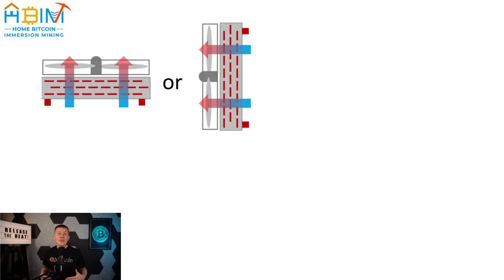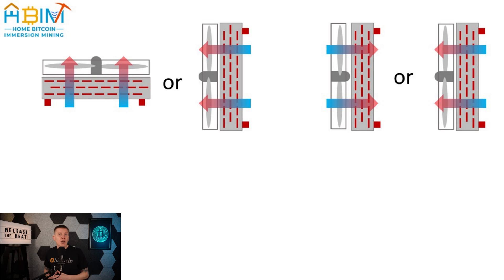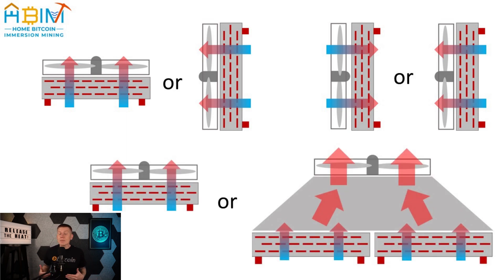When it comes to designing how you want to mount your radiator and fan, there are a lot of different ways to set this up. You can orient the fan and radiator in either a horizontal or vertical orientation, use the fan to either push or pull air through the radiator, mount the fan directly onto the radiator, or use some sort of ducting to maximize efficiency. Any of these configurations will work. You need enough room around your dry cooler for air to flow freely — just like your air conditioner, a couple feet of clearance on either side of the radiator is a good rule of thumb. You also need to consider your local weather: either buy a fan that can handle getting wet, or design some sort of shelter for the dry cooler that keeps the fan protected while allowing good airflow.